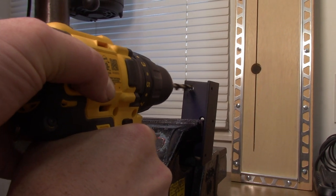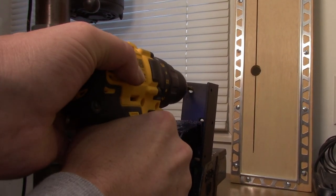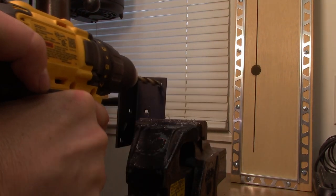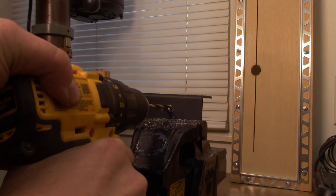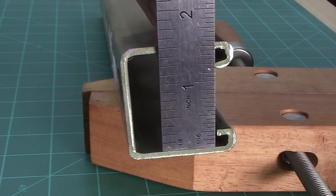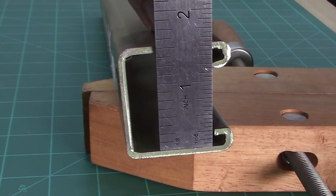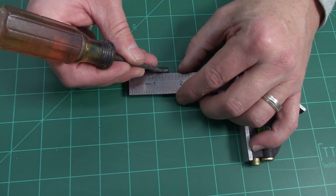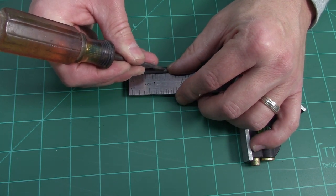The first thing I needed to do was enlarge some of the holes. I went to 21/64ths for where the roll pins are going to go through and the bolts on the bottom of the bracket. The width of the Unistrut on the inside is an inch and three-eighths, so I need to make those roll pins an inch and three-eighths long. Unfortunately I could only find roll pins that were an inch and a half, so I'm going to have to take the time to make these shorter.